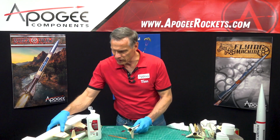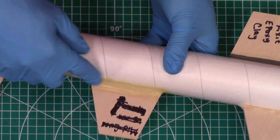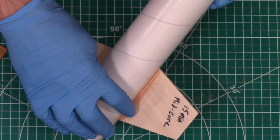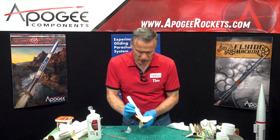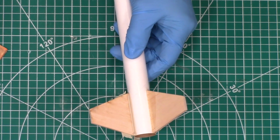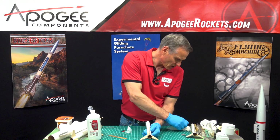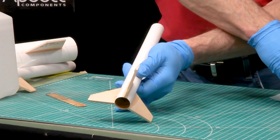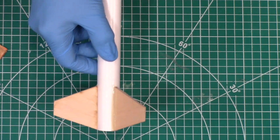And we'll let that harden, and when that does harden, it will look like this one right here. Nice. It has a fairly smooth texture to it, and it feathers out really nice. It's not as shiny as the liquid, but it's not too bad. And it stays put. You know, I could have it vertical like that. And these that have the tape on them, if I remove the tape, I'll have a nice sharp edge on my epoxy joint, on the fillet there. This one you can see it really nice, that nice sharp edge. Just like that.